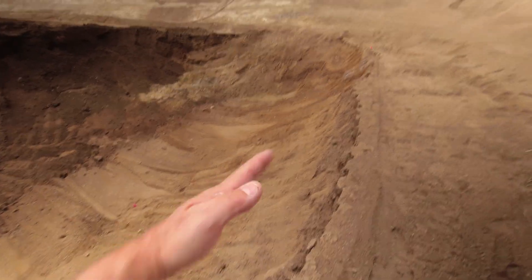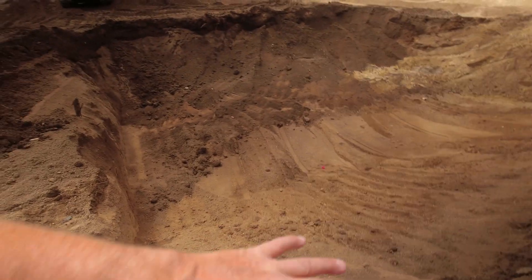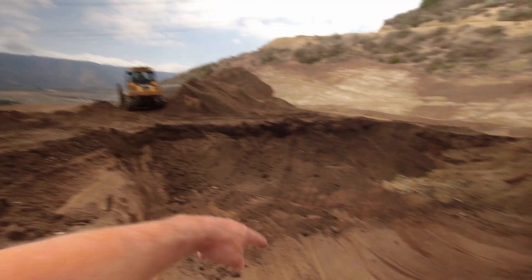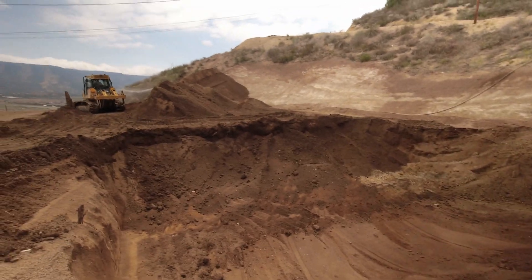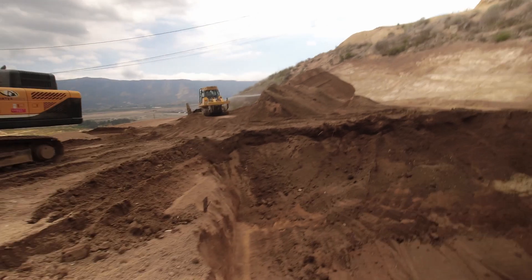We went down on a slope on a two-to-one so it doesn't cave in. But this entire lot that you see has to get excavated down to that depth. Then we need to put the dirt back on top of geo grid and compact it with the vibratory. That's the plan for now. We're going to continue forward to get this thing done for Dustin. We want to get this lot done in the next couple of weeks, but there's a lot of work that still has to be done.